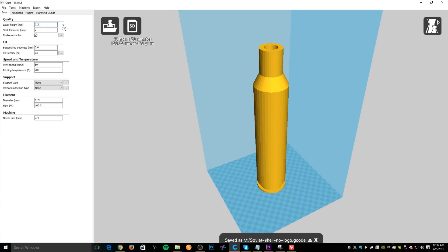At this size we could still print the shell much larger, but we're starting at about half the build height so we don't burn a ton of filament on a print that takes days. For our settings: 0.2 millimeter layer height because 0.1 would take forever, shell thickness of 2 for a thick wall, and 20% infill — though honestly you don't need any infill on this. We'll print at 70 millimeters per second, 200°C on the hot end, and filament diameter set to 1.75 — this is my first printer that doesn't use 2.85mm filament. Unfortunately, a mistake I made was leaving the nozzle size at 0.4mm when the Rostock uses a 0.5mm nozzle by default, which caused some under-extrusion. Estimated print time: 25 hours.